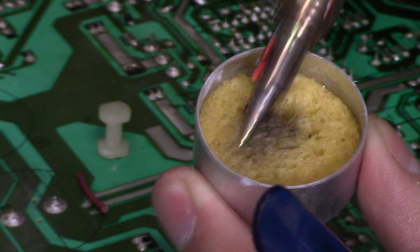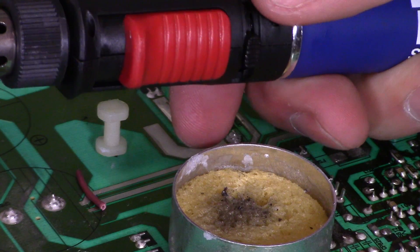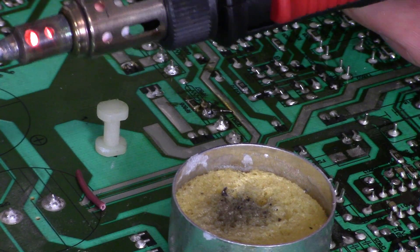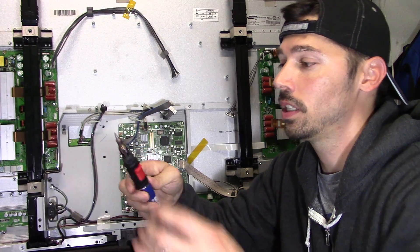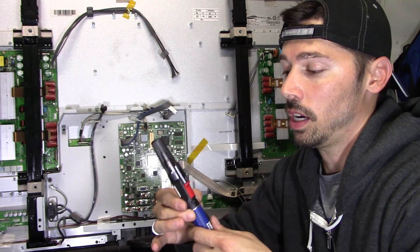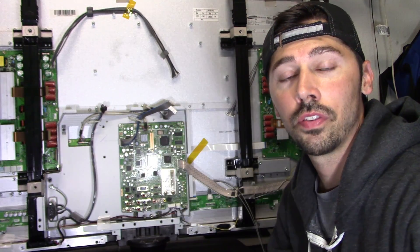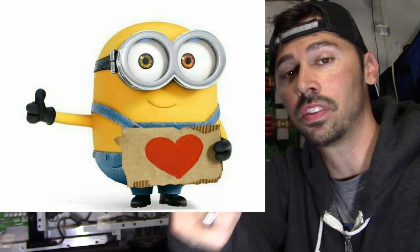Every ten solder joints, you want to clean the tip — you'll make the soldering iron last a lot longer that way. The whole entire time I had it on middle setting. If you have it really high, you're going to waste your butane, and it starts to melt the plastic right here. So you don't want to leave it on high setting. So if you guys are interested in this Isotip butane soldering iron, in my opinion it's one of the better butane soldering irons — if not the best one I've ever used. Check out the link in the video description below. Click on the share button and share this video to anyone interested in soldering. Click on the subscribe button if you want to subscribe to Tampa Tech for more how-to videos. And give me a big thumbs up if this video was informative.